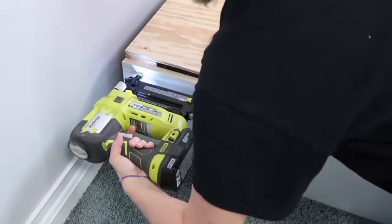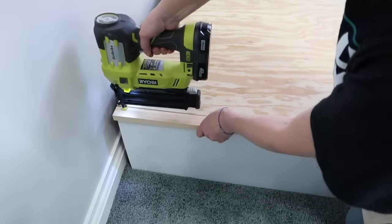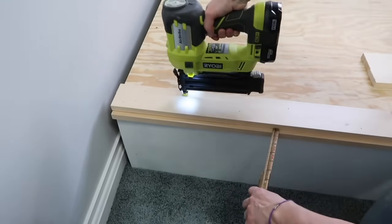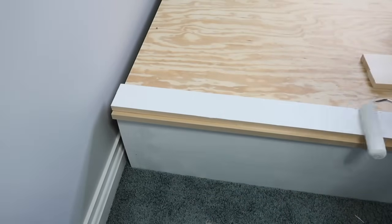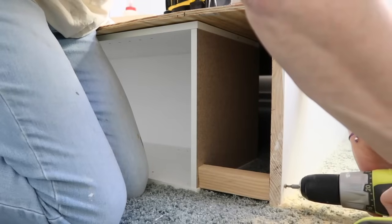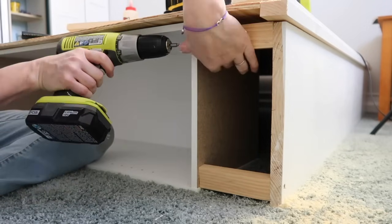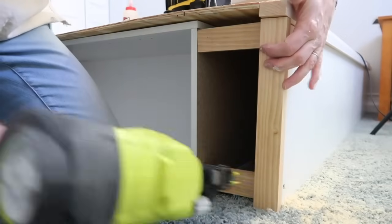The painted one-by-twelves were attached to the U-legs using brads. I then laid a one-by-two beside the plywood on top, overhanging the one-by-twelves, and nailed them in place. Then I laid a one-by-six on top to hide the seam and nailed that in place. After the entire bed was done, I painted everything white. At the foot of the bed, the storage unit wasn't as wide as the bed and there were gaps on either side, so to close those gaps I used two one-by-twos as a frame and nailed a one-by-two along the side with a one-by-twelve to cover the gap.